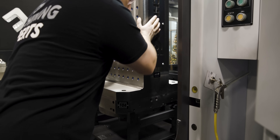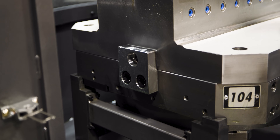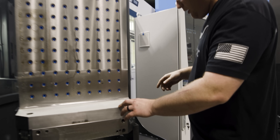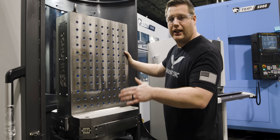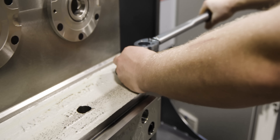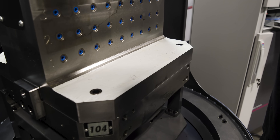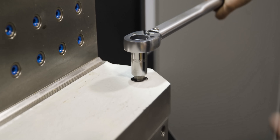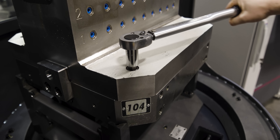Set her down there. Now this one didn't come with bolt holes on the sides to really mount it to these side plates, so I really want to make sure that I'm butted up against this side and the back side. What's pretty cool about this station is normally they either go 90 degrees or 180, but this one can actually lock in every 45 degrees, so that's pretty cool. I'm just going to put the first two bolts in. I went ahead and torqued these down, but I want to make sure that this is true with my X axis, so I'm going to go ahead and put this in the machine and run an indicator across here. And then if it's off, I can just loosen these bolts up and knock it around where I need to. But for now, I'm just going to go ahead and torque these down.